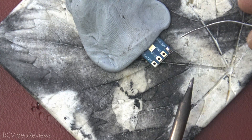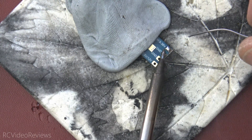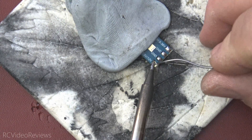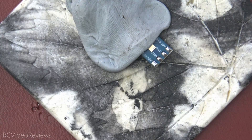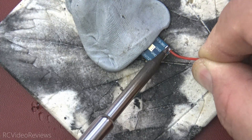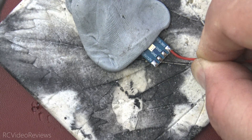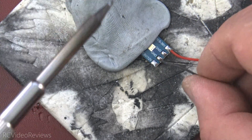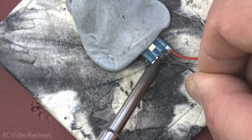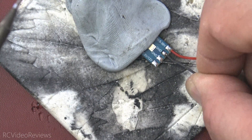Just a little bit of heat — there we go. A nice little pad right there, there's one connection, and there goes the second one. Perfect. And the third one — very nice. And there's the fourth one. So four nice little solder balls there, no problem. Now I'm just going to connect these wires — the wires are pre-tinned, so I'm just going to set that on the pad and give it a little bit of heat and let that re-harden. There's the power input. Now we'll do a ground wire — I'm going to re-flow this pad, drop my wire on there and get that seated. We'll let it cool. That looks good.